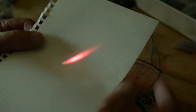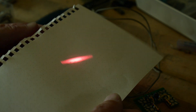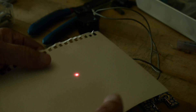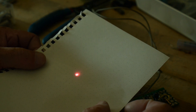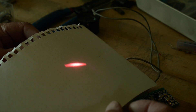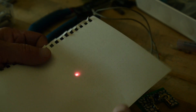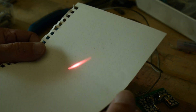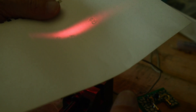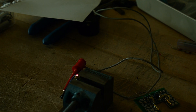If you make a laser spot somewhere and it looks really good, if you got a magnifying glass and looked at that spot, it would be oval in shape — not round. Laser diodes do this. We're looking at a particular type: an edge emitter, a cleaved laser. There are other types like vertical cavity laser diodes — VCSELs — and they may have round spots, but these edge emitters have a really weird divergent beam.